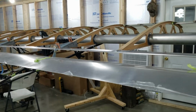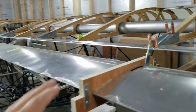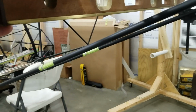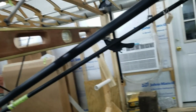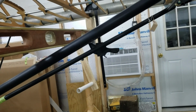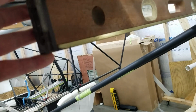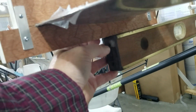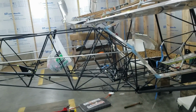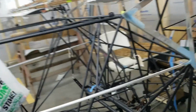Guys, we got the wings back on it, working on getting it rigged up. We leveled this mechanism here. Quite a deal. You have to make a 2 13/16 inch block that goes in the front, and then you level the piece that you made for the flaperons. Then you level the other flaperon with that. And then just read your book, because it's quite a deal.